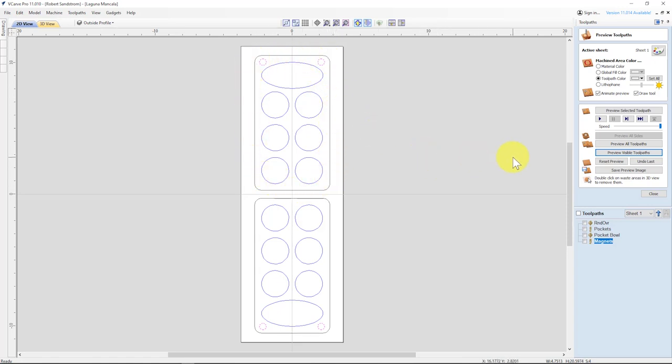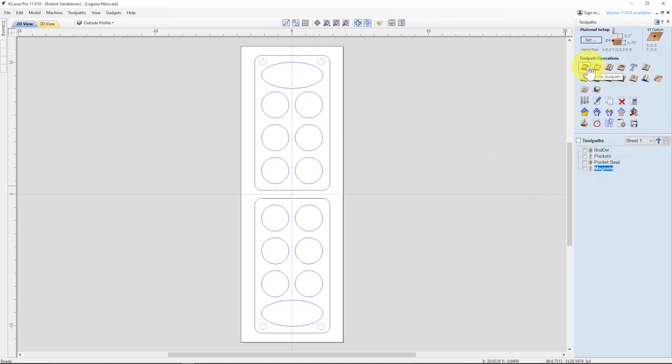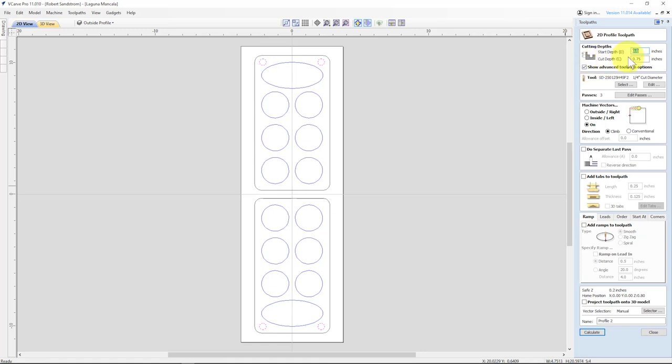And so now I'm going to go through and set up that toolpath, the profile toolpath. I want to go down to Z, which is the thickness of the board. I want to use a downcut bit. So this is a downcut quarter inch. Everything looks good. I do not want to be on it. I want to be to the outside, right. I like to use this little wire frame here.